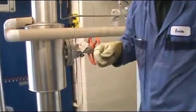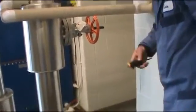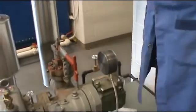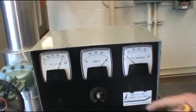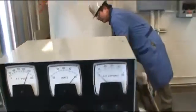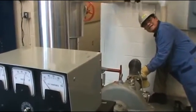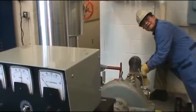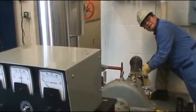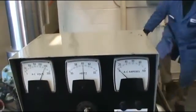The next step is to check the frequency on the generator. In North America we want 60 hertz, so we need to make sure it is at 60 hertz. Right now it's way over — almost 65 — so I need to turn it down a little. By turning the governor I can slow down the turbine and the frequency will drop. Now it's 60 and a half, a little bit more — yes, it is 60.